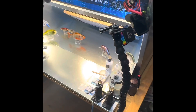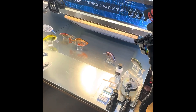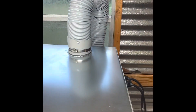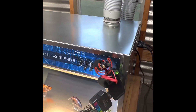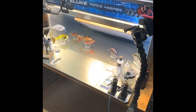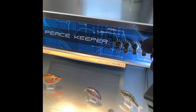The Pace has a very good extraction system in it — a 265 CFM fan that I can actually take out of the top of the booth and right out the window of my shop. That keeps any of the fumes out of my building, because I've set this one up to spray my solvent-based paints.